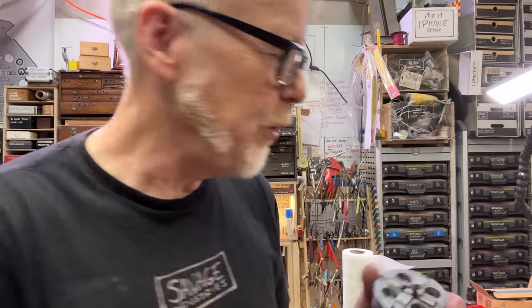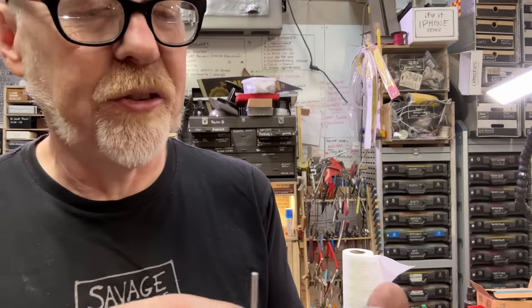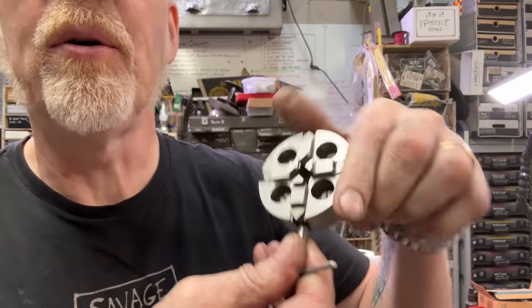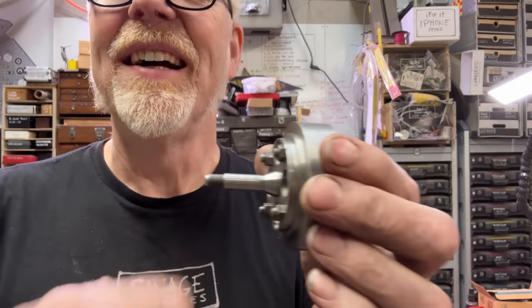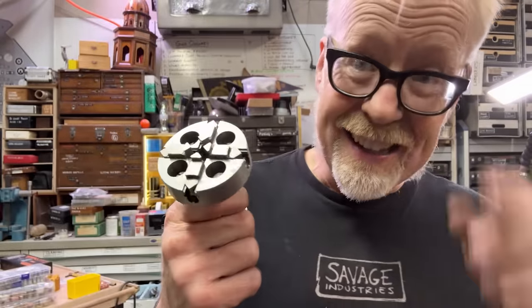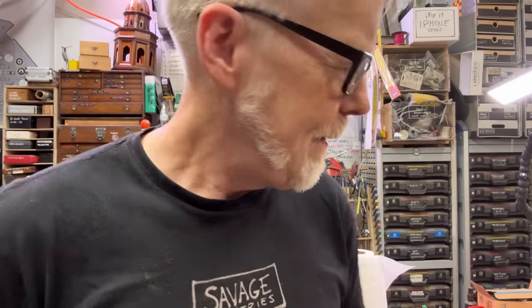I'm so happy. This is beautiful. This is a terrific addition to my watchmaker's lathe fixings. I managed to get all four jaws to move nice and smoothly. I'm very pleased with how well this turns, and it cleaned up really nicely. It looks really good. Plus, this all worked out really with some high concentricity. Yeah, a lot of your watch stuff happens at very high RPMs, and so concentricity is really important.